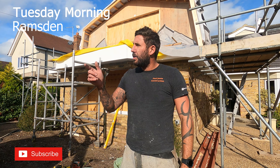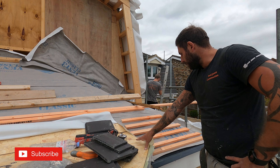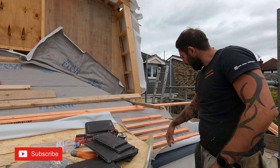Right, so we're finally at Ramsden. It's nearly half ten. We've been on the road since seven o'clock this morning on a wild goose chase trying to find these fiberglass trims at 150mm deep. But we've got it, we're here. Went and picked up 15mm plasterboard, which is not your standard board for Western Road, but because we've got 600mm trusses you need to use the thicker plasterboard otherwise you'll get sagging. Been to PGRs and M&J's roofing supplies. Got tiles, soakers, lead, all the fiberglass, resin, matting and all that sort of stuff. We need to get cracking, we're chasing the day now.